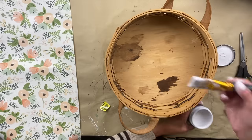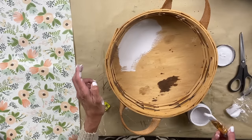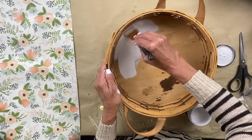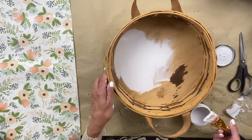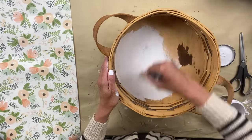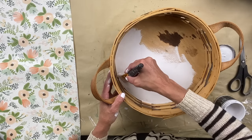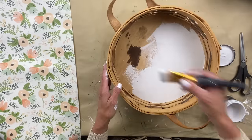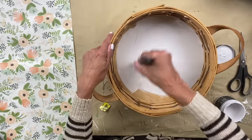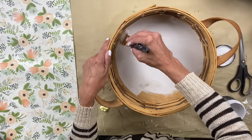I'm using DIY Vintage Linen. As I was doing the first coat, I thought maybe I should have clear coated it first, because instantly I could see it was going to bleed through — and sure enough, at the end it did start bleeding through. So I let it dry, applied a coat of clear coat — like a poly — to try to seal it all in, then redid another coat of Vintage Linen. It bled through again. I clear coated it again and it bled through just a tiny bit but looked pretty sealed. I thought I'd put the paper over it — but even after we put the paper on, through the paper there was a slight area where you could see a tiny bleed-through.